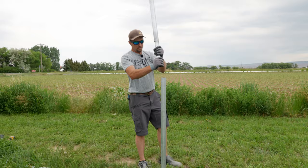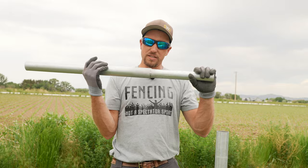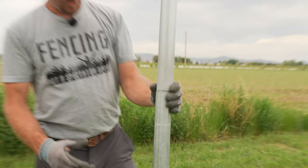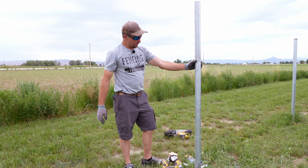This is an inch-and-seven-eighths post; the other two terminal posts are two-and-three-eighths. The line post is closer to inch-and-five-eighths, so the pipe fit is tighter — you can't get a weld up underneath between the two pipe seams like you can on the two-and-three-eighths. There's a small gap, and if you want to close it up, just take your grinder and bevel it out a little bit.